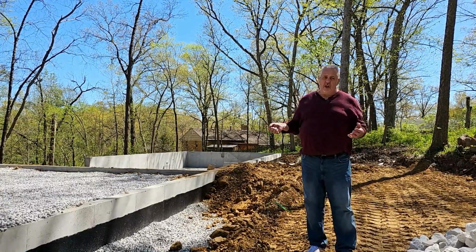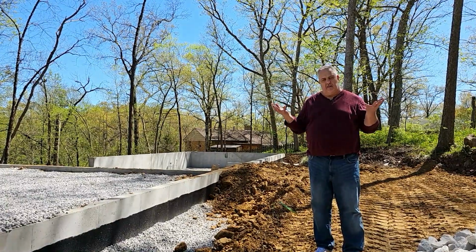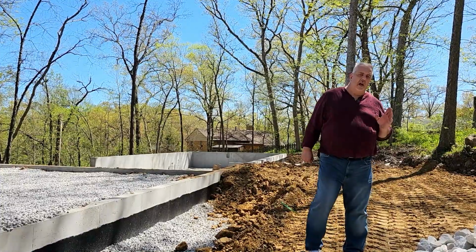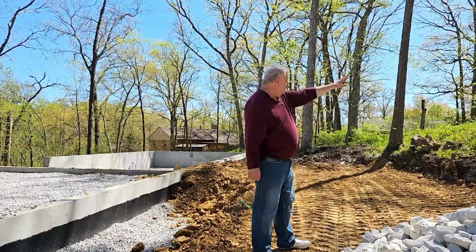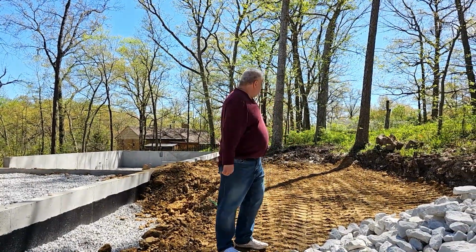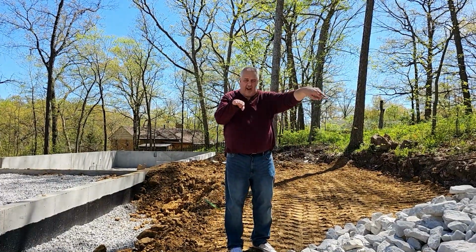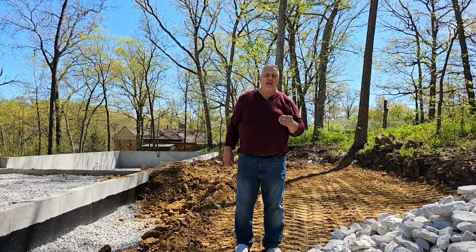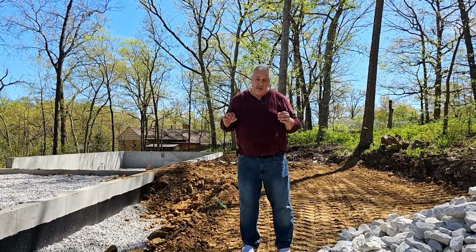Now, that works really good when we're out in a prairie or out in a pasture somewhere. We build an elevated foundation, we slope it away, life is good. But when we're on a job site here where we have high ground on one side and water clearly moves down to the site, sloping it back is just going to make a V. Now, we can take that and move that around the corner, which we will, but we have a slightly better approach. And we're going to walk up here and we're going to discuss a few things.